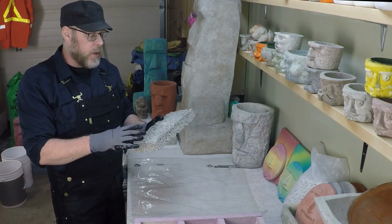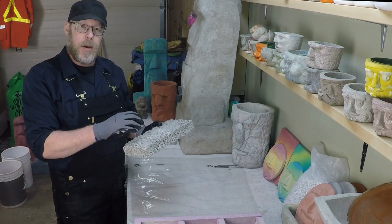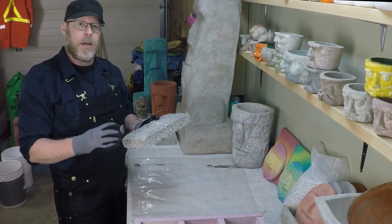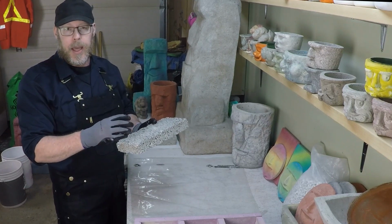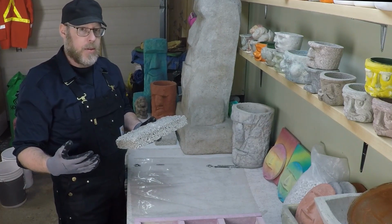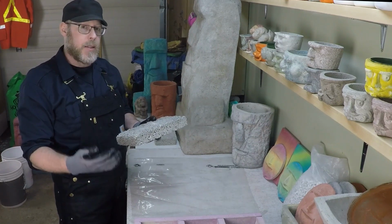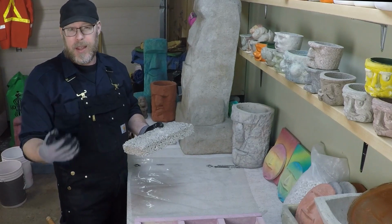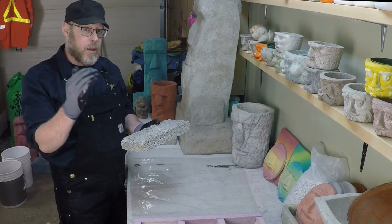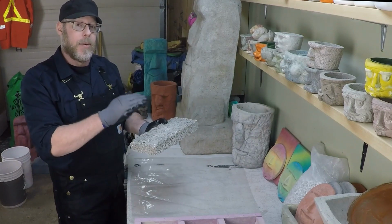An integral concrete sealer, often acrylic in base, is something that you would put onto concrete and it will absorb into the concrete. So it's not just on the surface layer, it's actually absorbing in. And further to that, there's other kinds of more advanced concrete sealers that you can get that are epoxy in nature, and they absorb in even further than that, because really the acrylic is still a surface layer sealer, even though it's more so than something that builds on the top layer.